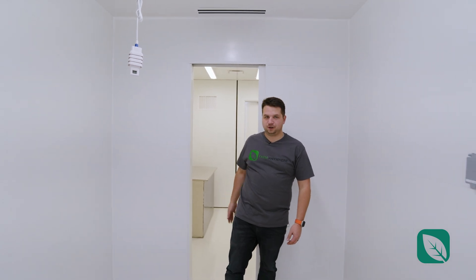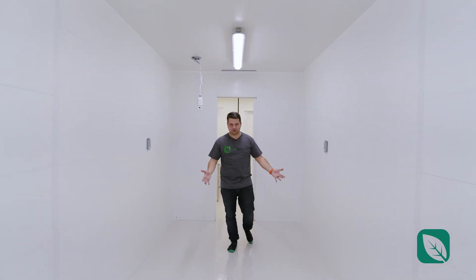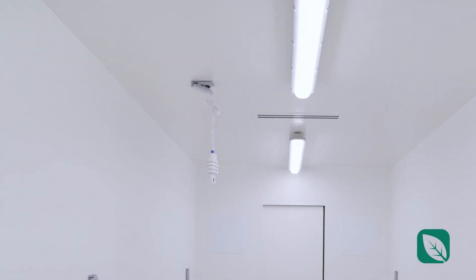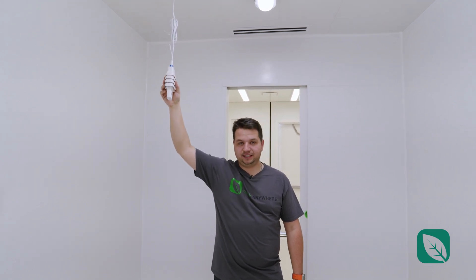Moving to the fruiting room — as you can see, we just moved here from the lobby. The nice sliding separation wall makes the best use of the space. There's plenty of power along the walls to add your own equipment. Also, this plug-and-play Hydro-X Pro sensor handles temperature, humidity, CO2, and light. You can remove and add them, and there are two of them throughout the whole farm, allowing a good average temperature reading and redundancy.